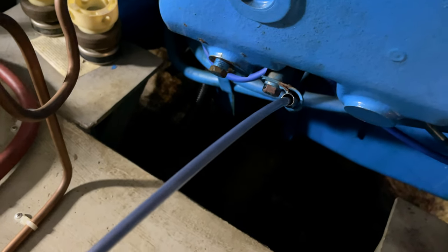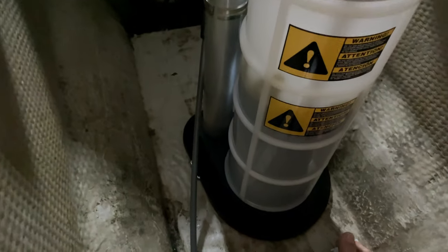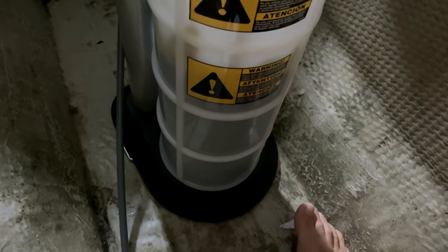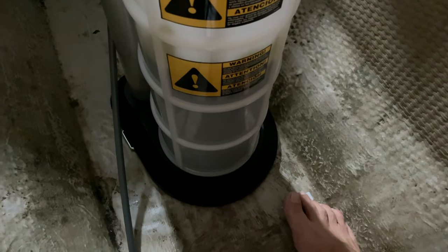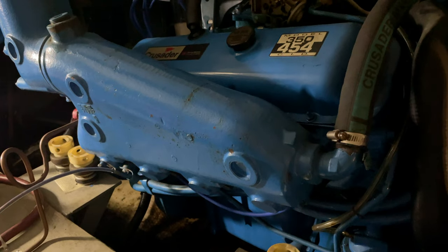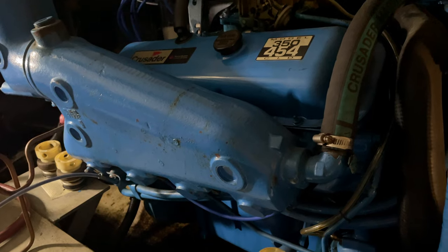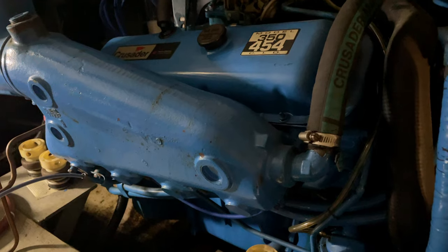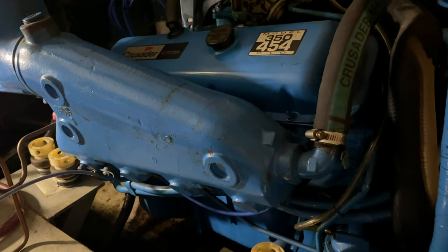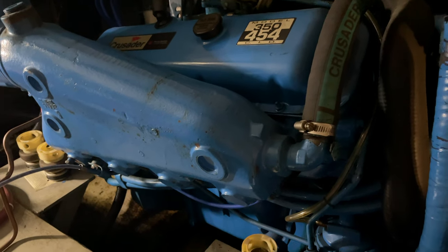Sounds like we're done sucking. Once that finishes, we'll take the tube out. You can see that our 2.3-gallon container is filled up just about halfway — that's good, we've got a lot of old oil out. You never get all the old oil out. It isn't like when you change the oil in a car and you drop the drain plug and everything drains out of the pan. There's still going to be a little bit in the bottom, but this is the best way without installing fancy equipment.